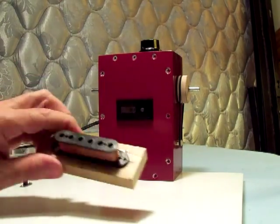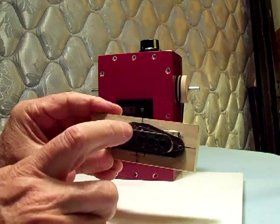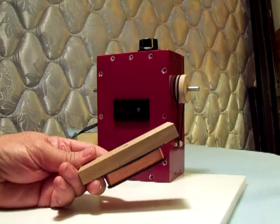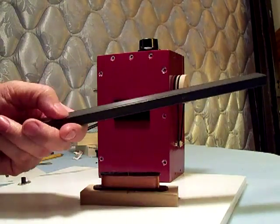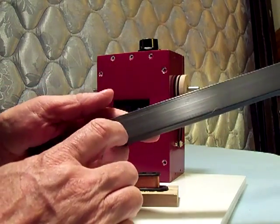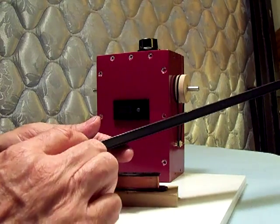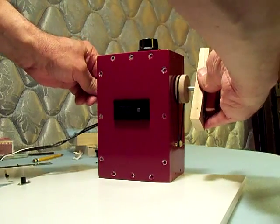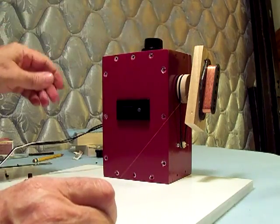Now I've got this piece of wood here made to hold the bobbin — this is the pickup itself, and it's called a bobbin. I just made a bobbin holder out of a block of wood, a piece of half-inch thick poplar. I've also got a piece of aluminum here that I got from McMaster-Carr, about ten bucks. I'm going to cut that and make two, one for each side, out of this anodized aluminum. I have to cut it to the right length, bore a hole in the center to fit the quarter-inch shaft, and then drill a hole in the edge in the center to meet that other hole, tap it, and put a set screw in there to hold it in place. But for right now, this wooden one holds on the shaft pretty decent because it's wood and it's kind of tight.